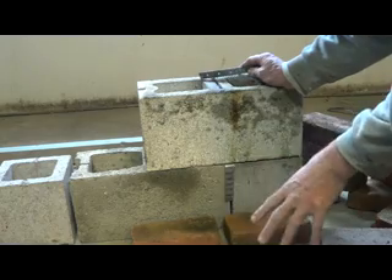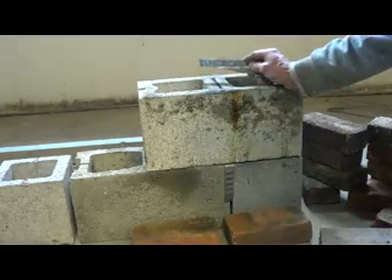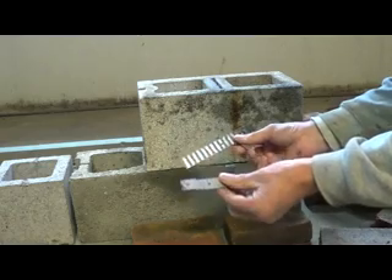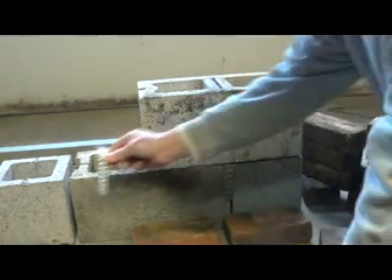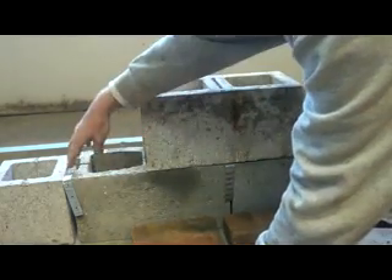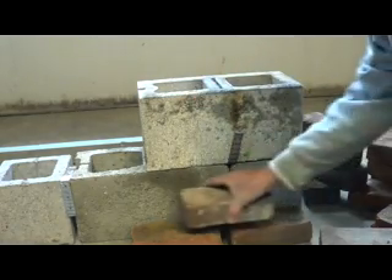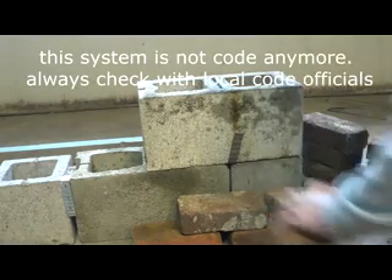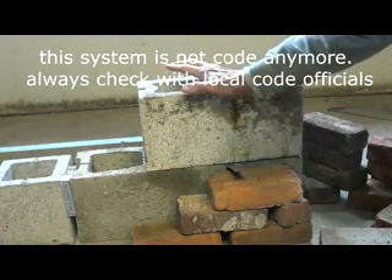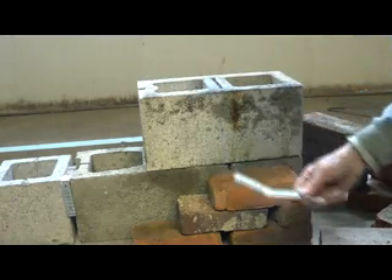The point is they didn't really use a lot of wall ties in the old days. Then when they did block work — mostly residential — they went to little metal wall ties. You'd bend them like this, cement them into the block, then bend them up when you laid your brickwork. But that's against code now; they don't do that anymore because these metal ties would rot away really badly.